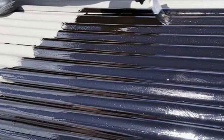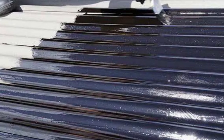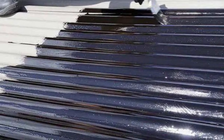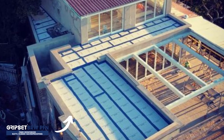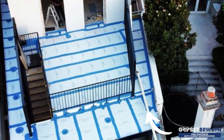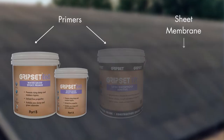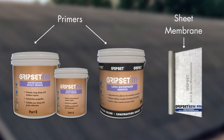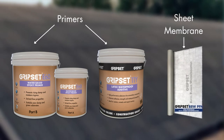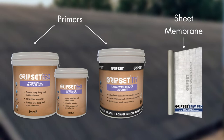There are so many different bitumen systems that have arrived into the country over the last 50 years, and it's important they are never treated the same. Once you've confirmed your primer is working, you can put your system of choice down — whether it be one of our sheet systems or liquid membranes — then complete the detailing. The important part is that pressure cleaning alone is not enough; that bitumen residue is active 99% of the time in my experience, and you must cover it to ensure no adverse reactions from the bitumen coating into your new membrane system.